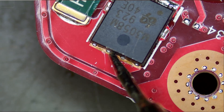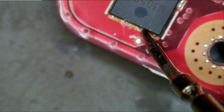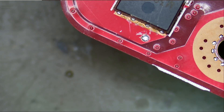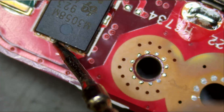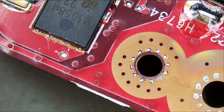If we inject voltage here — no amps being drawn. My ground probe is not connected properly. If we try again and inject voltage here, I'm getting a 2.6 amp draw, which is a definite short.